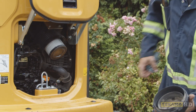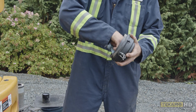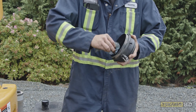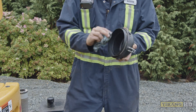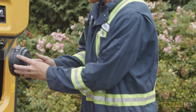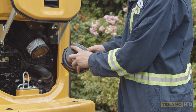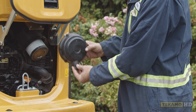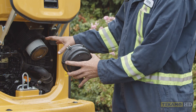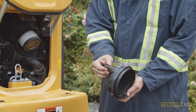In the air filter housing you can see a little bit of dust — I like to give that a little bit of a wipe out. Makes it a little bit cleaner. Now on this air filter housing, it does say 'top' with an arrow pointing up. This valve here needs to be at the bottom, so if any dirt shakes out while the engine's running, it goes through a little hole and can escape through this valve right here.